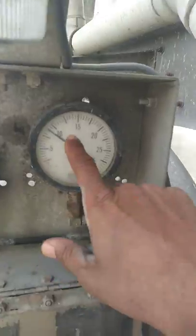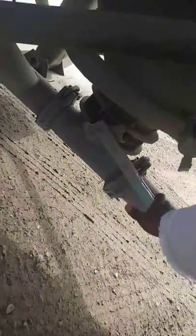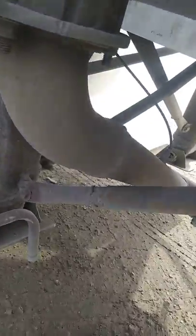You want to go back up to the front. Close the valve, wait till the air pressure gets around here, and then open it. Now the product is back-flowing into the tank. Repeat that — time to three, open. The truck will bounce up and down to let you know that the product is back-flowing into the tank.